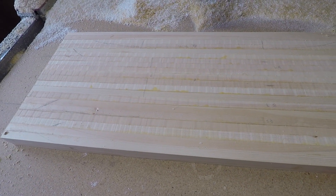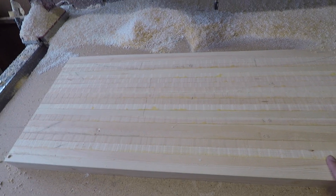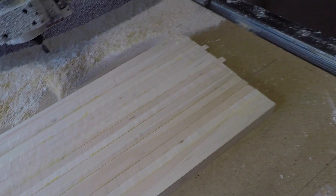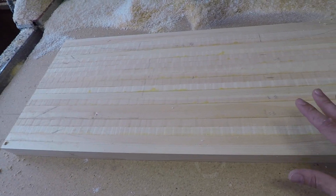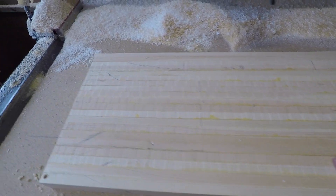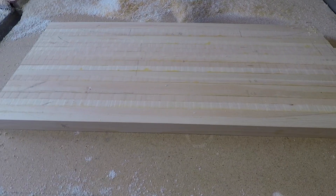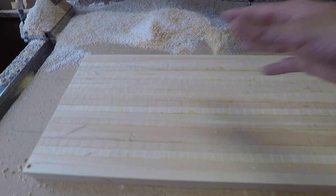An update on the chambered board: it's all glued up and I just mounted it onto the table. Now I'm going to take the CNC and face the top side — I'm probably going to take about two and a half millimeters off, then flip it, do the other side, take another two and a half off, and then cut out the profile.